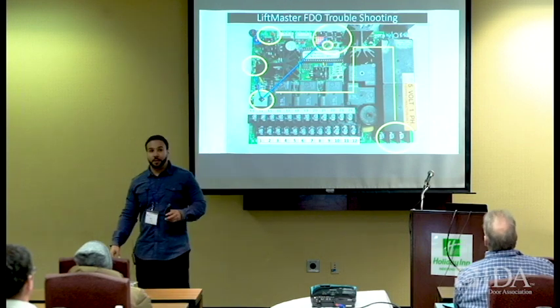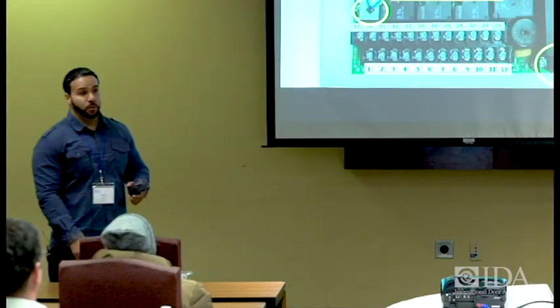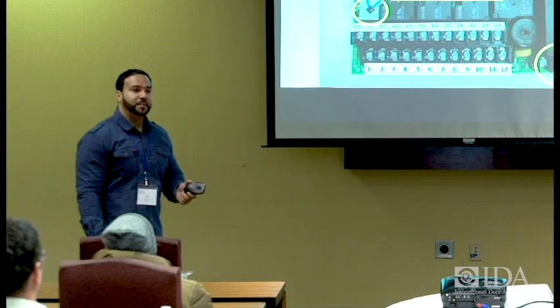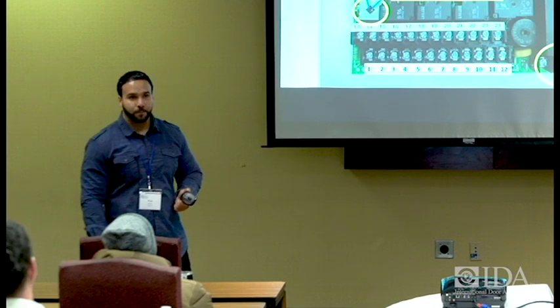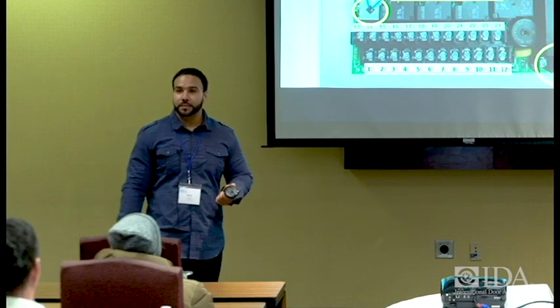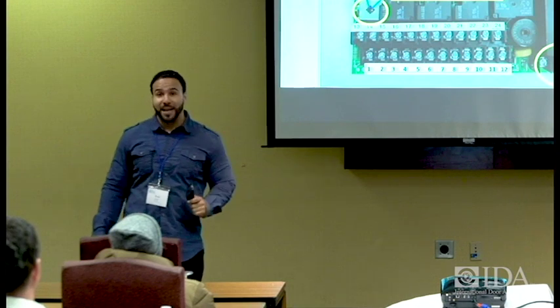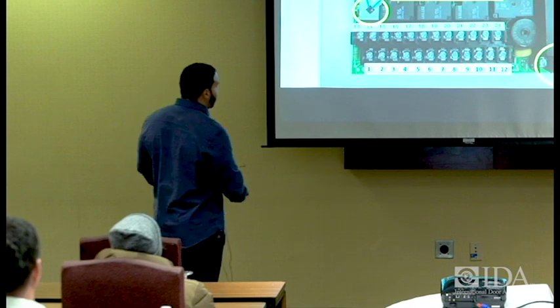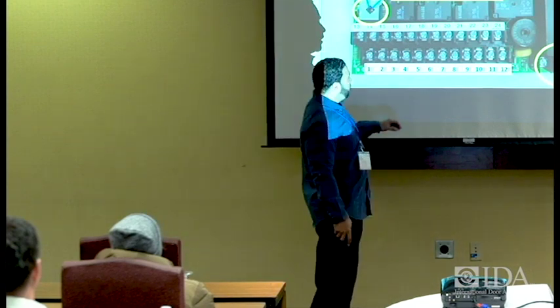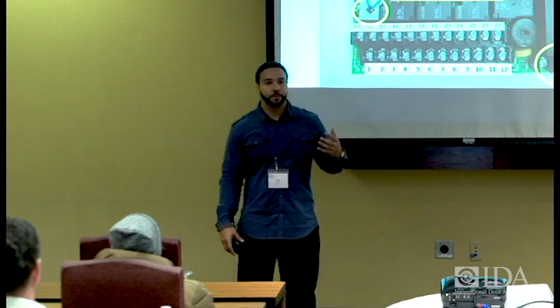From a functionality standpoint, we then have to verify that everything is working right. Is my safety device working right? Is my push button working right? If that stuff is not working right, then at that point, you want to start looking at your alarm contact circuit. You want to see what's going on with the interfacing of it all. It's connected to a building alarm system. Is that building alarm system a C-form dry contact? It should be, because no voltage shall pass between the alarm circuit on this operator, because if it does, it will damage the components in the operator.